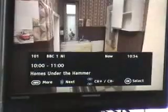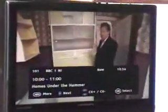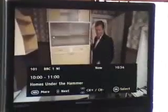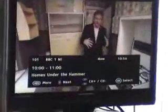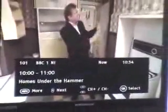It's fully programmed up now and pulled in 162 channels, and that's it. If I come along here and press the information button, you'll see I'm on BBC One Northern Ireland. So that's it from beginning to end. How to install a Freesat box, enter the postcode, and get to a point where you're actually viewing television. So you can see the whole process only takes 4 to 5 minutes, and that's it from beginning to end.